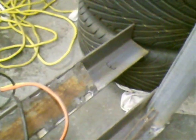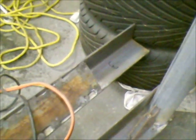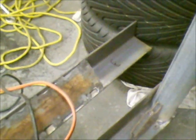Here's the brace. The actual folding part that goes at the top. I went down through there and got it welded up pretty securely and got it all ground down flush. So there's a couple of brackets that weld to it, and then there's bolts that go through those to sandwich the metal whenever you're using it, and they actually go into those nuts that are underneath the legs.